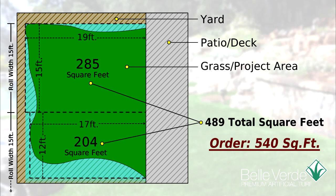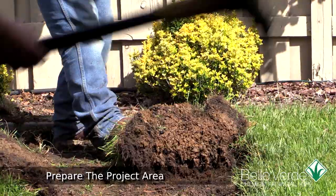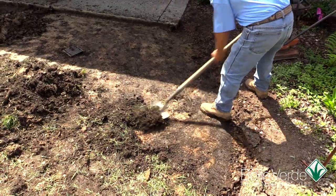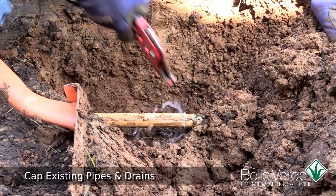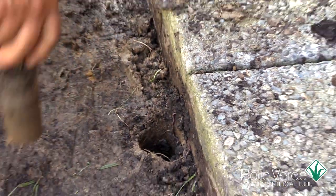Even if your project has curves and areas that won't be covered with grass, always measure to provide enough material to cover the entire area. To prepare your project area, you'll remove all the sod and seeded lawn grasses, root systems, and amended soils. Rent a dump trailer or a waste container to haul debris away. Using a flathead shovel, scrape down under-sod lawn areas until you reach native compact soil. You can leave irrigation and lighting intact, or simply cut and cap the main line and remove and cap sprinkler heads in the project area.